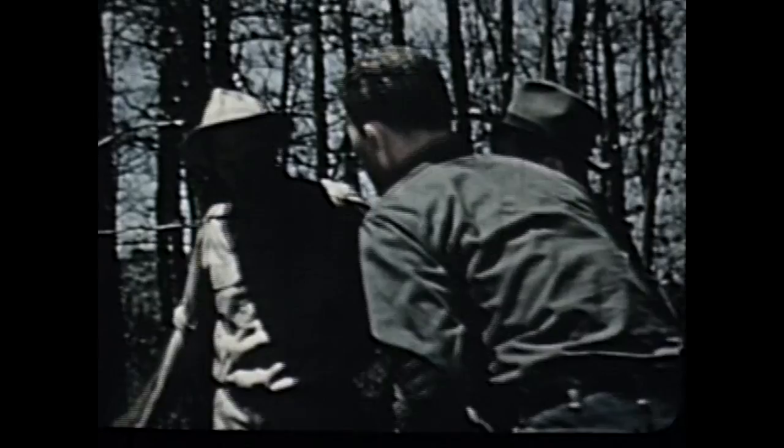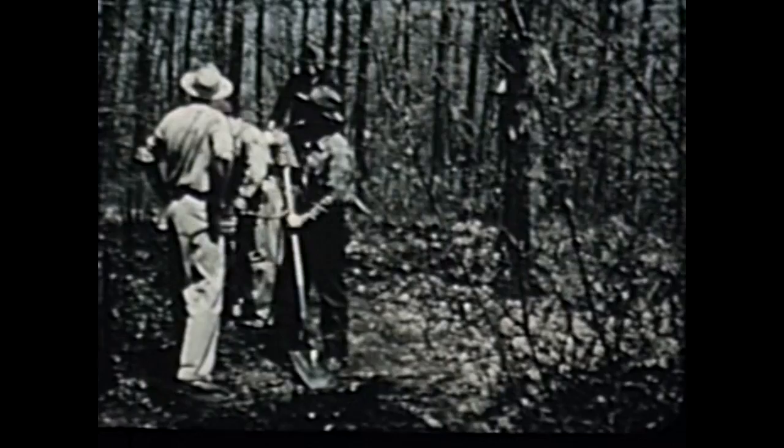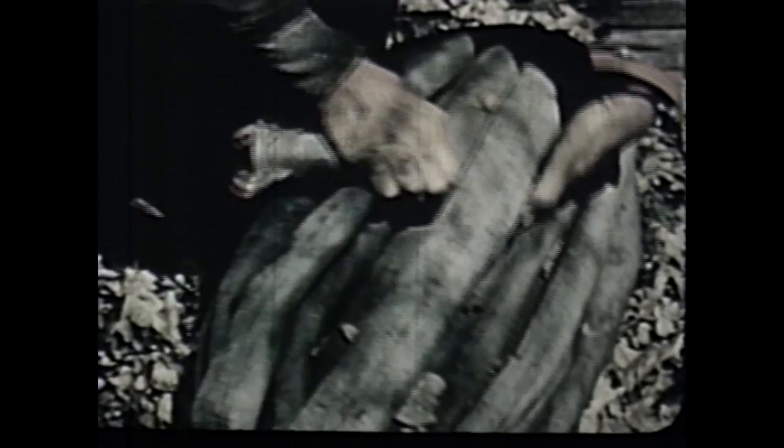When we finished mop-up, I left several of the men as patrols and the rest of us turned to getting our equipment out of the woods. Since it was still daylight, we did up the hose in watermelon rolls. The watermelon roll is started with a loop two or three feet long; after one wind has been made, it is twisted slightly before making the next turn. This process is repeated until the entire length is rolled and the loose end is tucked under to prevent unwinding. The resulting bundle is neat and easy to handle until it's taken back to headquarters for washing and drying before being repacked.